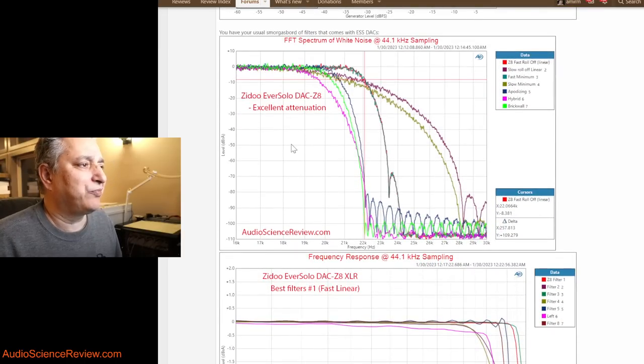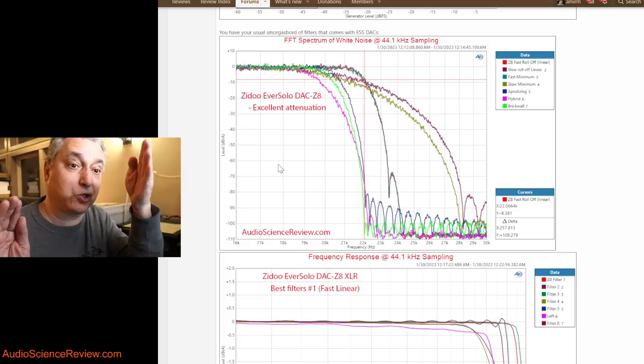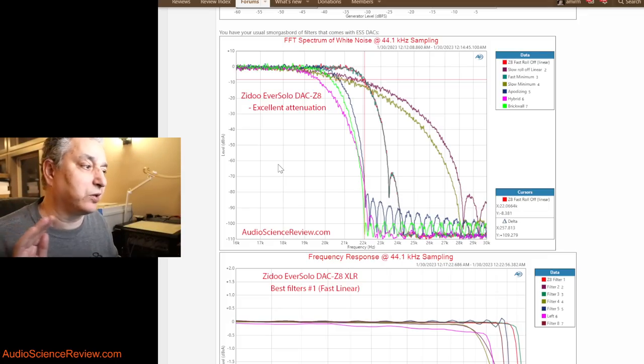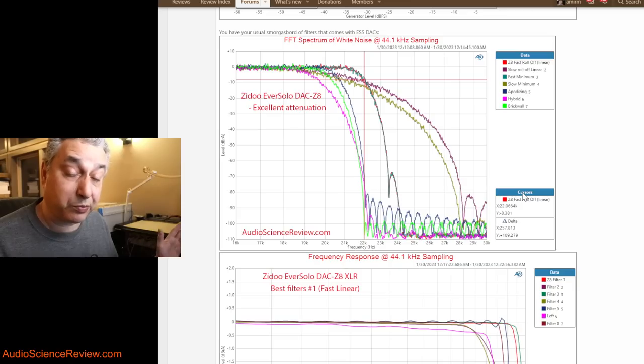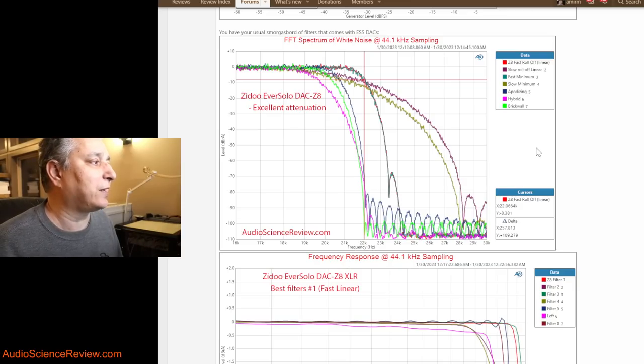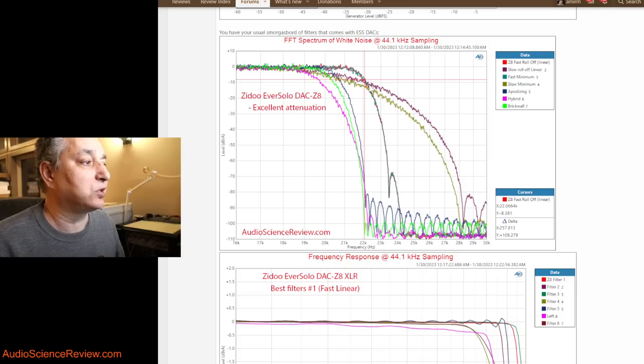Okay. These other tests are a little perfunctory, but people are curious. These DACs are what is called oversampling DACs, and they have a digital filter in there. And that digital filter can be programmed to either have a very sharp response or a slow response. The reason you need to have a filter at all is because the whole process generates spurious ultrasonic information, which you're supposed to chop off. And instead of having one algorithm in there and having people argue whether that's the best one or not, most chip companies actually give you a choice of many. In this case, there's 7 of them in here.